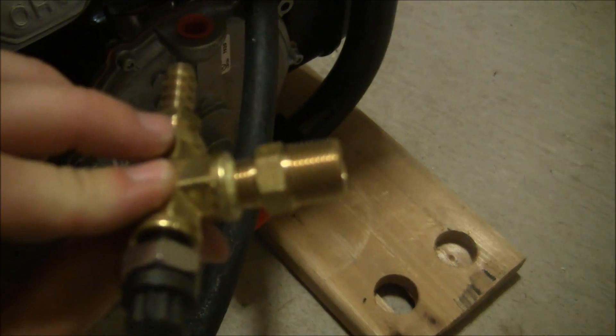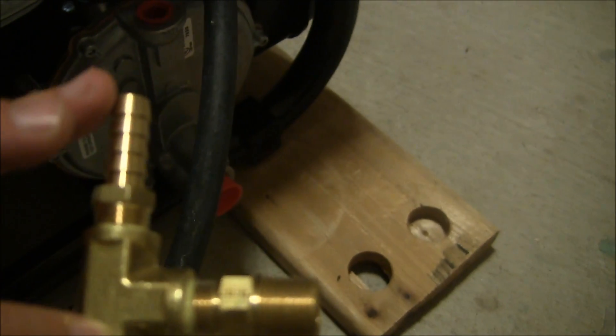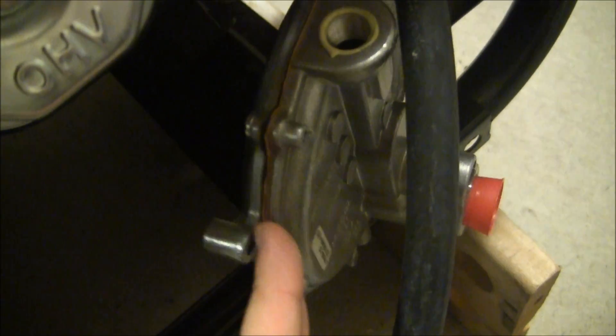I applied some paste to both the 3/8 inch and 1/4 inch side. The directions also say to put paste along the nipple here, and then tighten up the clamp on one side. I'll put paste here and sealant and tighten this up. This will be a pretty good position — I might have to pull it out just a little bit to give it a little more distance. I dug under here a little bit with a screwdriver and was able to pop out that cap, so now I'll paste this up and insert that in there.